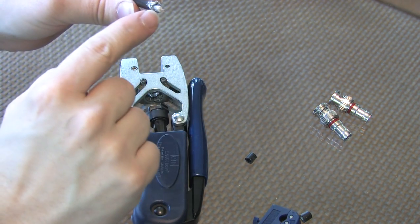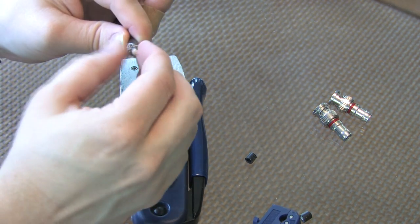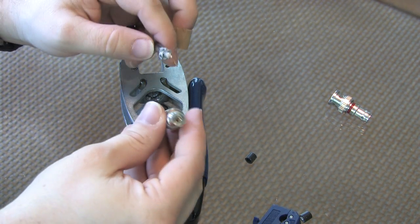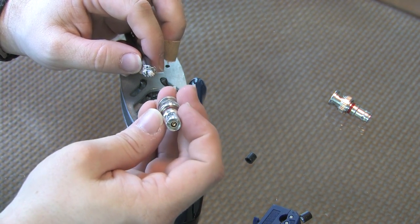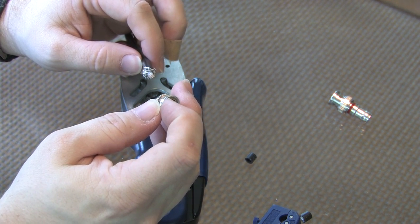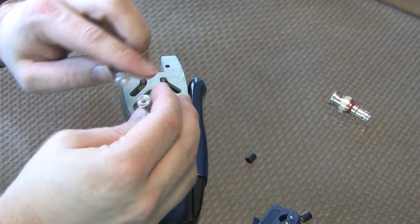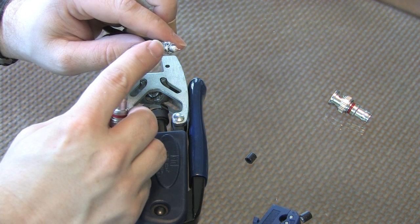You'll see that the foil is still tight around what we call the dielectric — the white part inside the center of the cable — and that's okay. We just want to visually make sure again that there's nothing touching that center copper conductor. Now we'll take our BNC end, and if you look in the end that you're going to insert the cable into, there's a gold-colored center pin that's going to go around your copper conductor, and there's an outside shielding connector that goes between the foil shield and the wire braid on your cable.